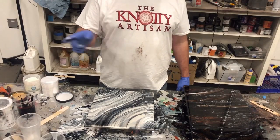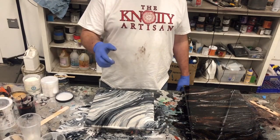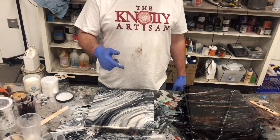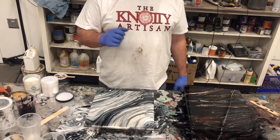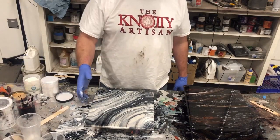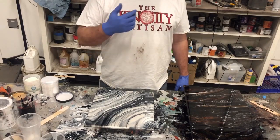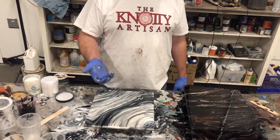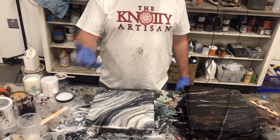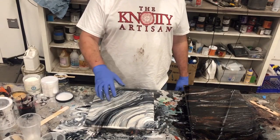I hope you like this. I'm gonna drop a link on where you can buy this Poly Aspartic and the colors used in this video. If you have any questions, drop them in the comments below. One question I get asked a lot is: could I pour epoxy and then put the Poly Aspartic over the top to keep the epoxy from yellowing? The short answer is no — the UV rays are still gonna hit the epoxy and all epoxy will amber. That's why this product is so cool: it replaces the need for epoxy. Just use a Poly Aspartic.